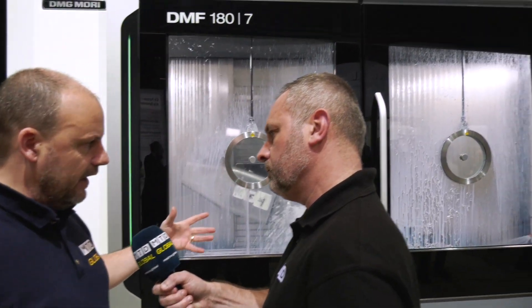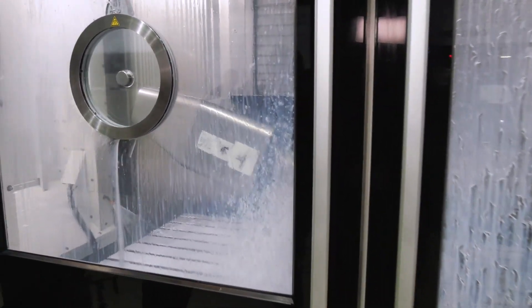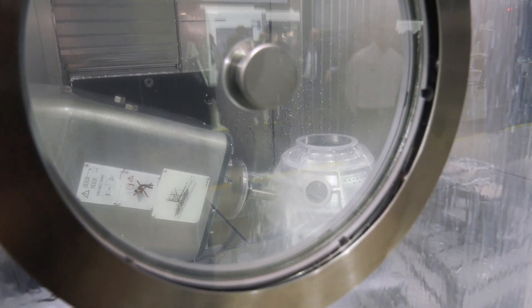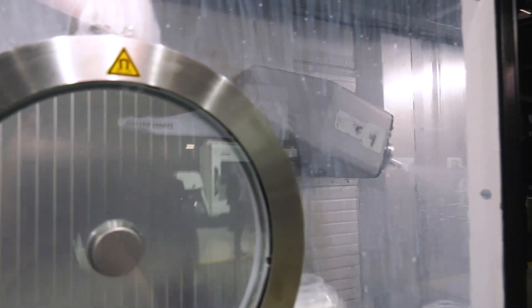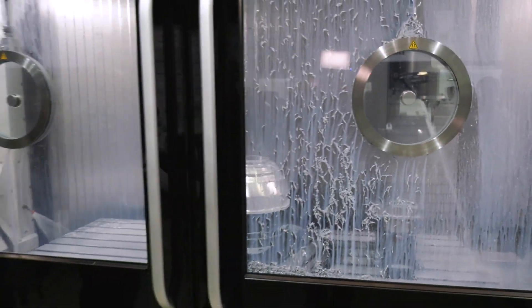I picked this one out — it stands out for me because I see quite a lot of Travelling Column requirement in the market. Why would you want a machine like this? It's a Travelling Column machine. Your X-axis is moving on the column at the back, which means your table or your bed is fixed. By having a fixed base and fixed table, you can put heavier parts on the table because the table is not moving left to right as an axis — it's in a fixed position and you're relying on the head or the column for your movement. Some would say that's advantageous.